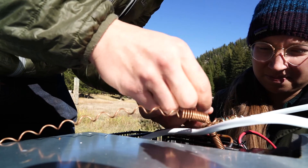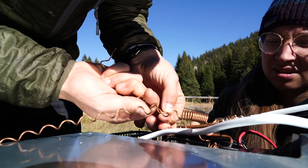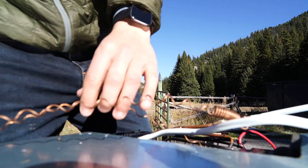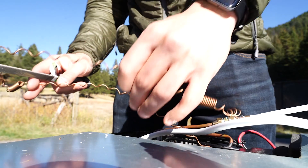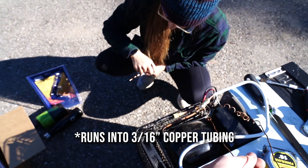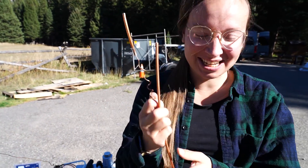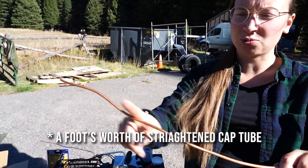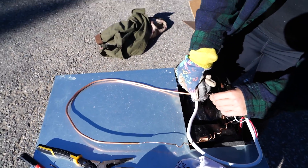This is the other capillary tube we're pulling from to join the two. We're very gently straightening them out. We marked the midpoint — you can see a black dot on each — and we pulled them out. We did a practice solder test on a small scrap piece and it looks like it worked. So we're doing the same on the fridge with the full copper fitting, putting about a foot's worth into each side. It's not the cutest but both capillary tubes are in that copper fitting. Super important to be careful with capillary tubes — if they kink it changes the inside diameter, which is literally the size of a pin needle. We soldered the left one, cleaning up with steel wool, then applied a little flux as primer before soldering the right one.